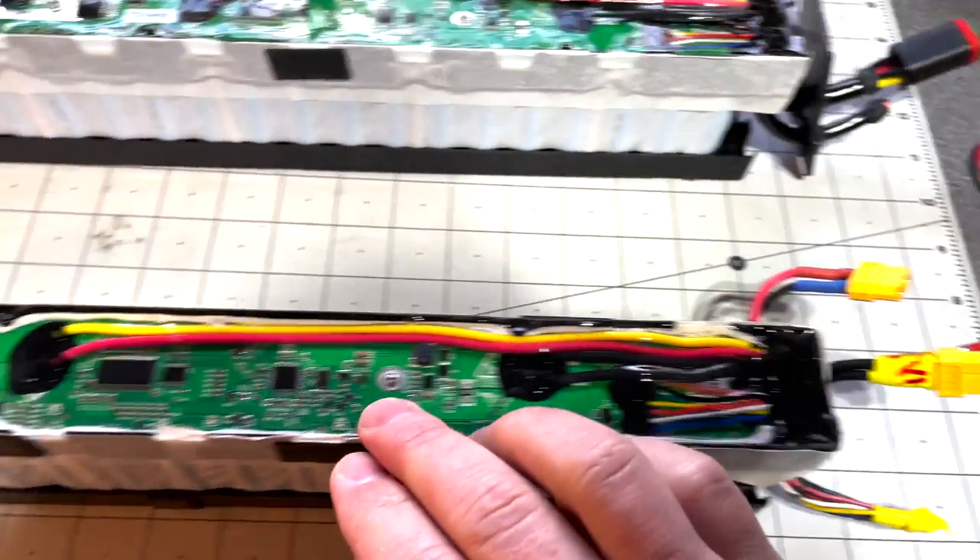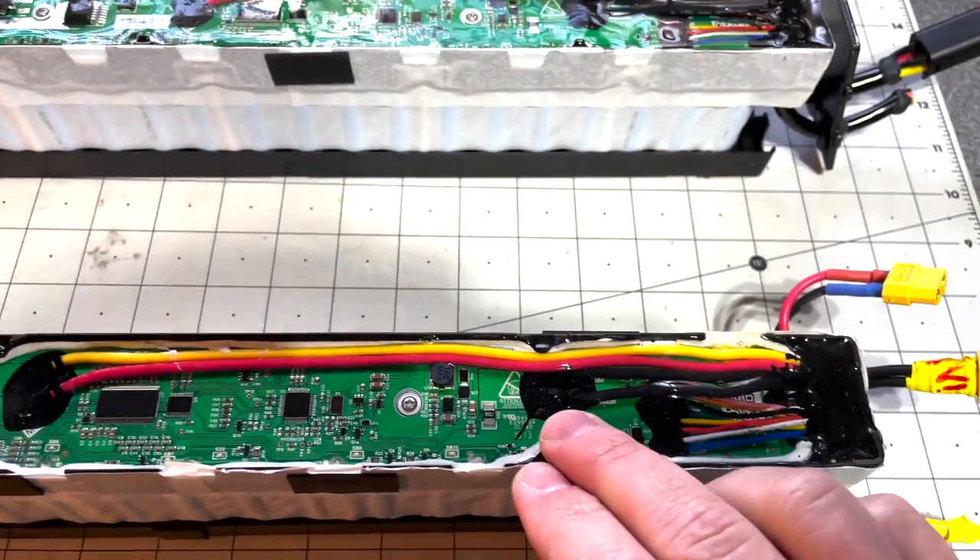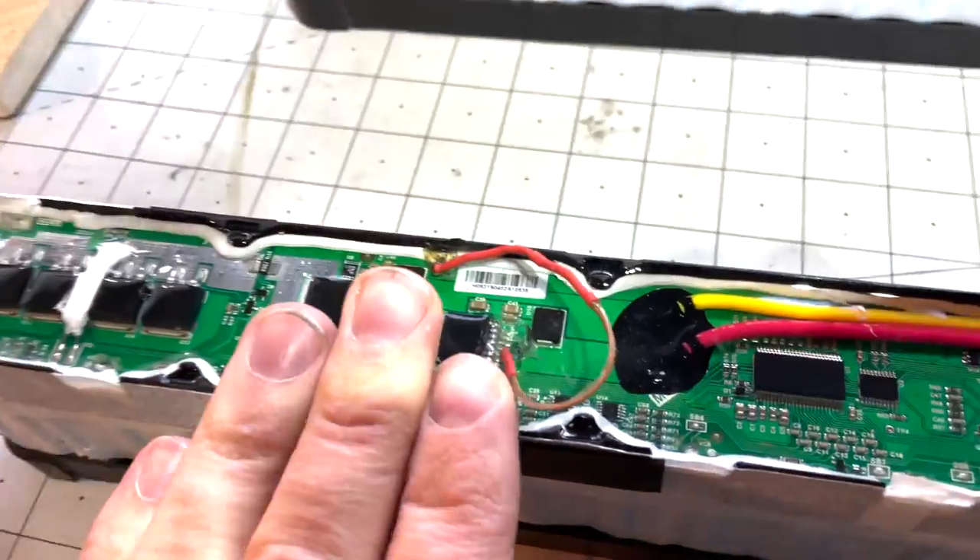From a safety perspective, I would recommend you take the voltage of the pack first. If it's below 30 volts, you may have some cells that are bad and you may not be able to get it working — not all BMS boards will respond to this hack. This did work for my first one; I'll try the other one next.